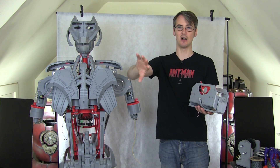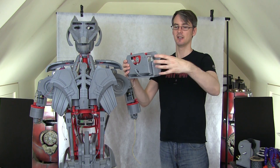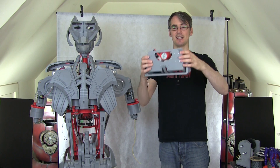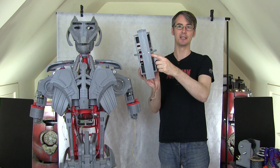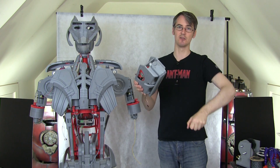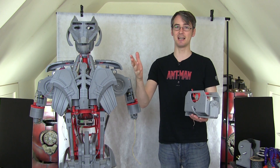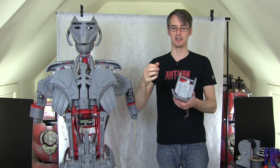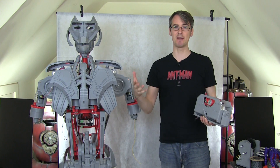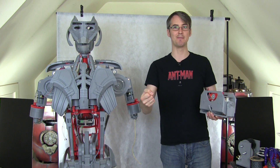The rotation of the arm isn't going to be too hard because we're putting the hand on the end coupled onto this piece. We can have a compliant section between the hand and the forearm with the sensor in it, rather than putting it on the output gear — so if you grab its hand and twist it, it knows you're twisting it. The only slightly tricky one is pulling the hand up, which I think is going to be compliant anyway — rubber tendons and rubber fingers that are quite compliant — so you can get your hand out if it grips you. We could also use string tension to work out if it's being back driven if someone's really mashing the hand.